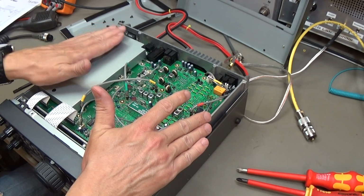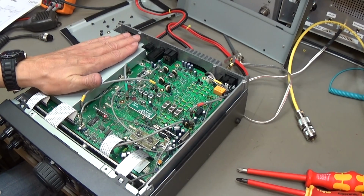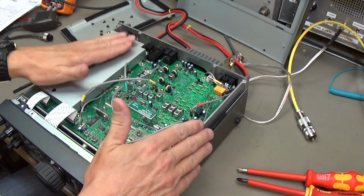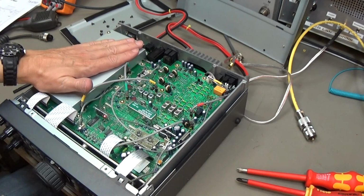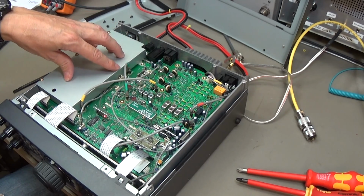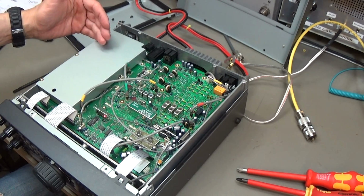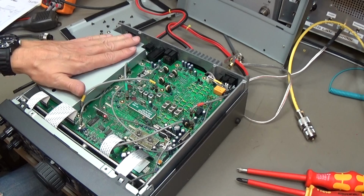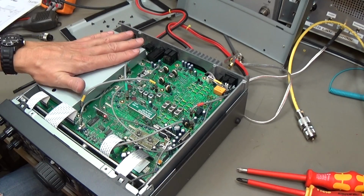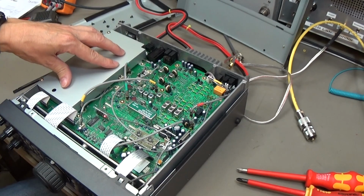You know, it is always critical to do alignment like this with the complete housing open, because then we have a different temperature, and the different temperature will have an impact on the reference frequency. So I'm not really happy with it, but anyways, we have to open it, and then we will see what we can do.